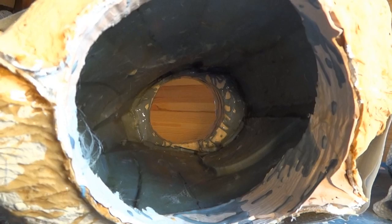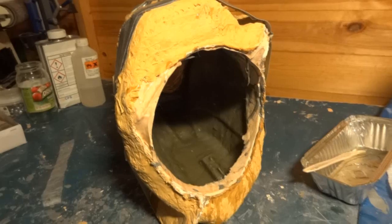It really isn't any fun at all, so I think I'm actually going to demold it after this and then do the original plan of cutting it in half and then reinforcing it. Right, it's much later in the evening now, so hopefully... Yeah, that seems fine. Polyester resin's gone off and it's all nice and cool, which means that the catalyst reaction is over. So basically I'm going to try and pull this out of the mould and we'll see what happens.